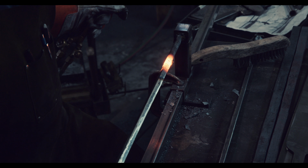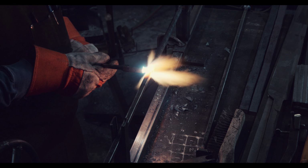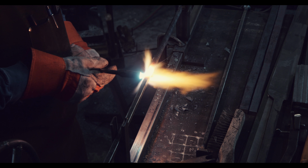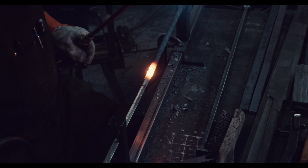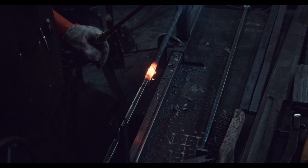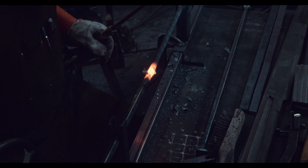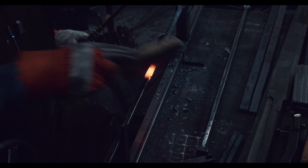As you can see, I'm twisting the first bar to the right. While not entirely intuitive, these directional twists are orientation invariant. That means no matter which way you flip the bar, the direction of the twists will always look the same. This also means to get a herringbone pattern, we need different twist directions. For that reason, I will twist the next bar to the left.